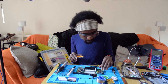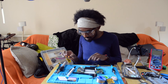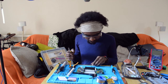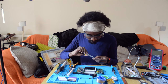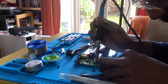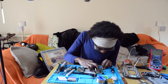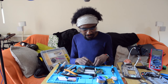There we go — sweet, perfect. I can bend it down. The capacitors I'm using aren't going to be the same square shape, but I'm just going to bend them back to make the leg and then solder it down and fold it so they fold in the same way, mainly so there's enough space once everything closes. We now have two capacitors replaced.